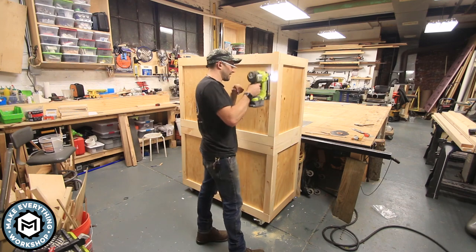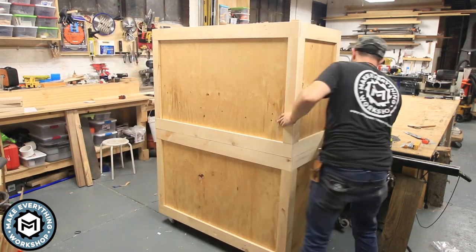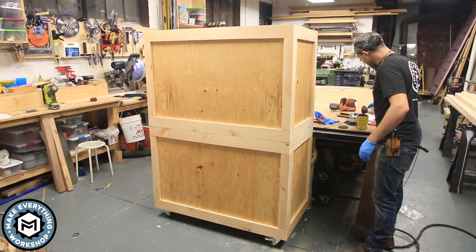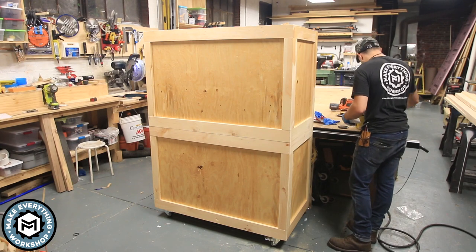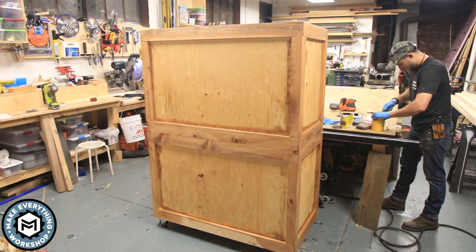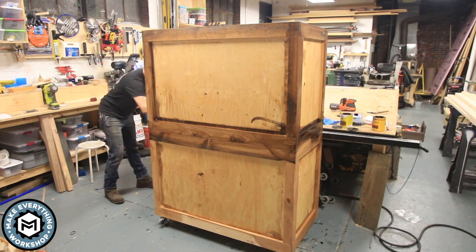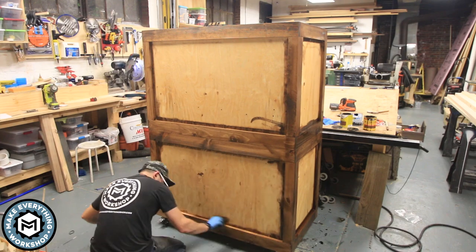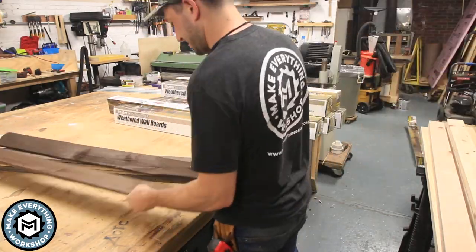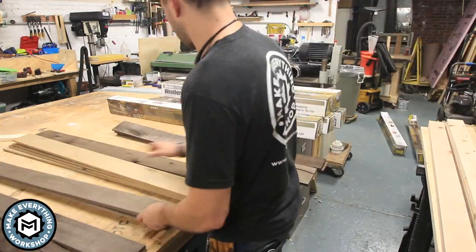The infill is going to be pallet wood. Normally I would rip up pallets and stain the wood myself, but with only two days to do this project there was just no time, so I wound up buying pallet wood from Home Depot. Before I apply the pallet wood, all this wood is raw and needs to be stained. Instead of staining in advance and worrying about those cuts, I decided to just stain it in place using a dark walnut stain, which gives a nice brown look. This clear pine stains up really nicely.